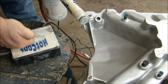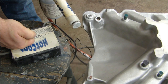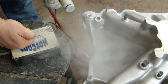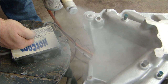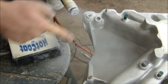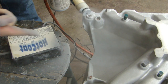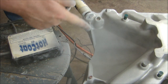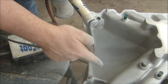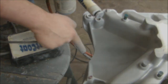Now watch what happens when it's charged. See how it sort of goes towards the part? Instead of just flying off in the air, see how it's sucking right to the part? It's drawn right to the part. Because in this mist of powder, the powder is even attracted to my finger because now I'm statically charged too. These particles of powder now have ions with extra electrons — they want to get rid of those electrons, so they're drawn towards the part because I created point charge Q with the ground on the part.